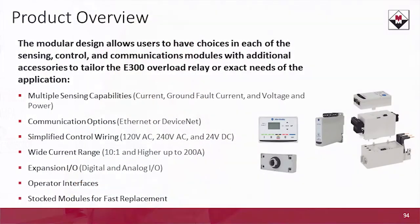If you have a critical motor application in your plant, we would really want to talk to you about using an E300 to monitor that motor itself. It has an add-on profile. You can configure it so that you can go in and look for specific diagnostic tags. You can get alarms to sound at certain thermal levels and things like that, so that you can make sure you are able to repair a motor before it has a critical failure in the field.